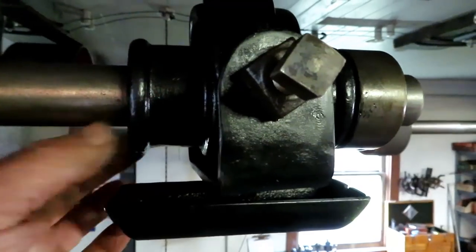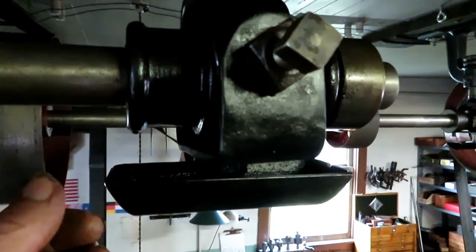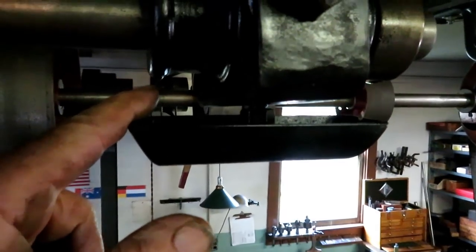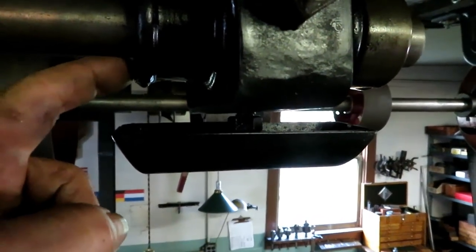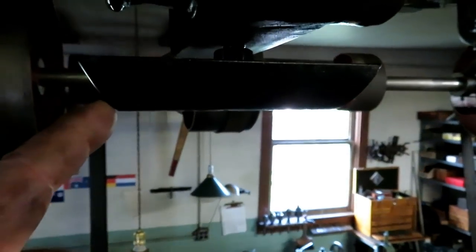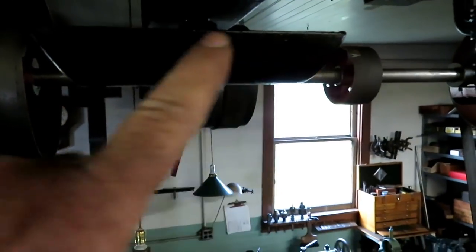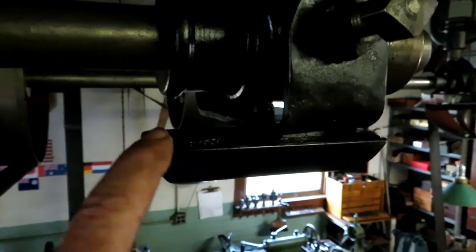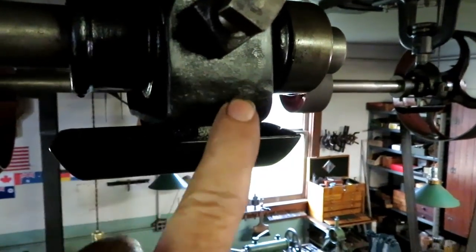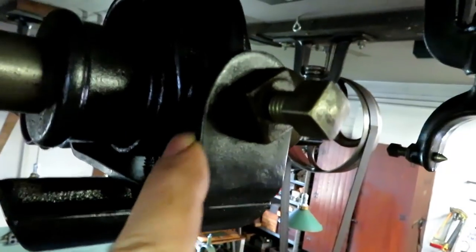And it's got these flanges on the end, which at first thought are ornamental, but as you can see, it causes the oil that comes out of the bearing to drip right there at that spot and be caught in this little catch trough here, which I have to make too. This is a safety thing that I added. It's a piece of pretty heavy stuff.